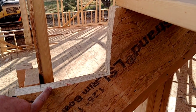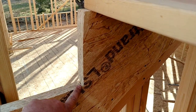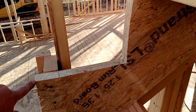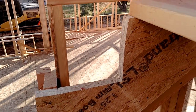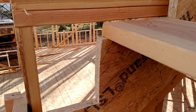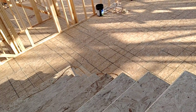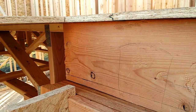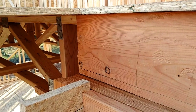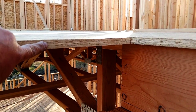When planning out your stair risers, the 7 and 5/16-inch dimension I mentioned ended up giving us about 10 steps, which is a little on the short side, but they didn't give us a lot of room to work with on this particular staircase. 10 will be fine. That 7 and 5/16 repeats all the way down the staircase — with the exception of the top, where the distance is different by about 3/8 of an inch because this stair tread is an inch and an eighth thick, where the other material is basically 3/4 of an inch thick.